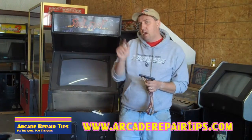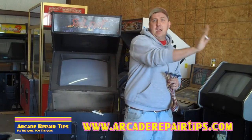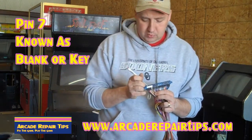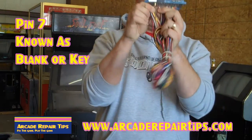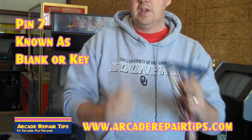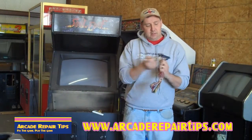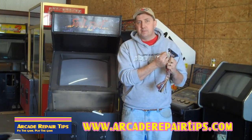From experience, you'll always find that a lot of your JAMA boards have six pins and then a space missing, and then more. Pin seven is always dead. So if you look at this one — one, two, three, four, five, six, seven — you see how this one has no wires going to it. That one has no wires going to it. I say dead; they use the word 'key.' So seven is your key, and you'll know that this has to be pin seven right here.